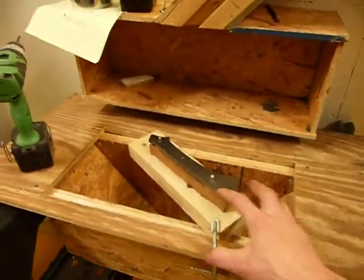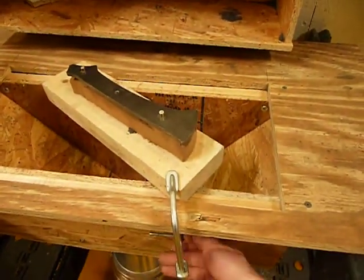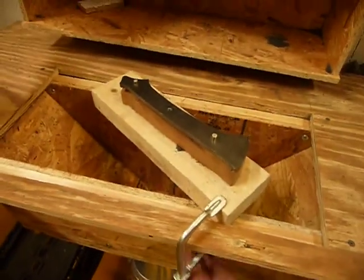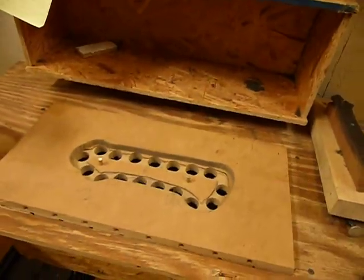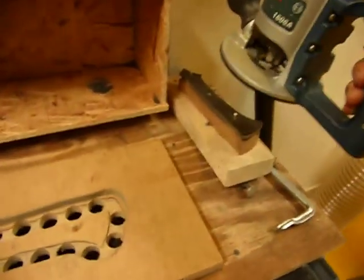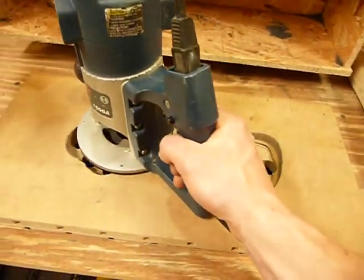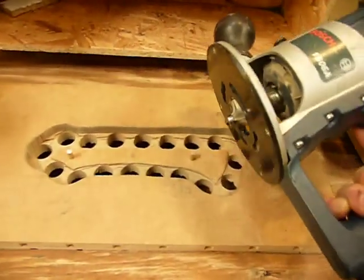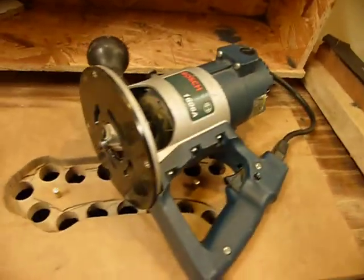This is an old jig I had to use to do one side of a tomahawk, but I made this downdraft arrangement so that I could collect most of the micarta dust. I'm also making it so it's easier to control the router operation — instead of having the router just purchase on a blank itself, it's going to be down in a pocket so the whole table constrains the router. All a person has to do is drive it around the template, which is made out of steel, and it removes material a lot faster than depending on the CNC to do all that work.